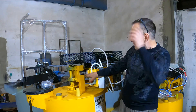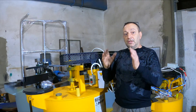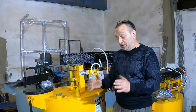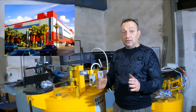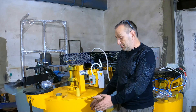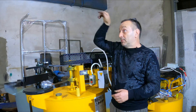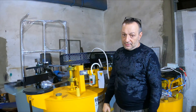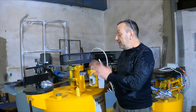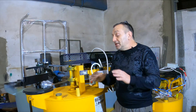What do I rely on in my judgments and arguments? This machine has serial number 2299. I base my judgments either on my own experience or on the experience of our customers. We had experience when our customers built the Magnet shopping center in Sochi. Our customer was making a batch of foam concrete mortar with a density of D400, so that at the height of the third floor, when the mortar was fed horizontally by 50 meters, the mortar density was D650. If the machine pumps the mortar using a concrete pump to a height of 25 meters, a structural change in the foam concrete mortar is guaranteed.